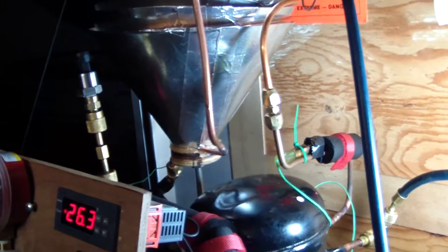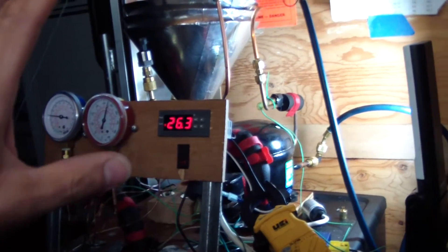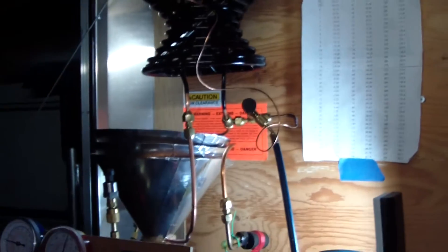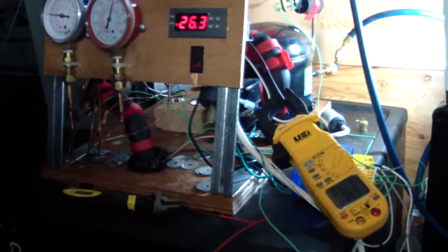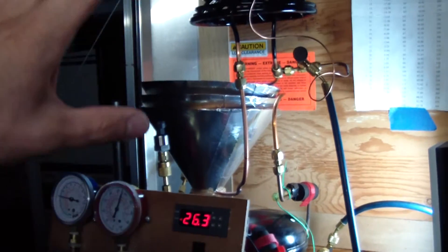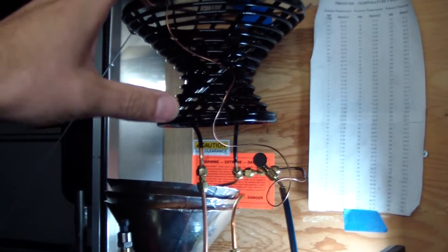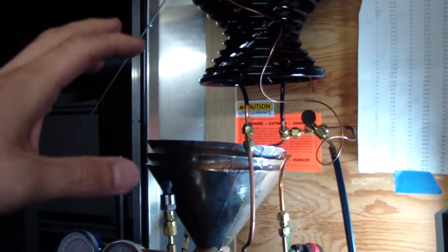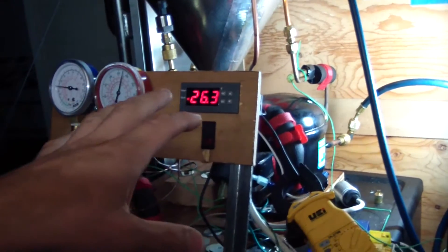There's a lot of reasons why I'm doing this. But essentially what I wanted to be able to do eventually was to build a small vapor compression refrigerator that has a removable condenser. It sounds like an odd thing, but I thought it would be a pretty nifty idea if I could make this thing modular in the sense that the cooling unit can be removed from the top of the refrigerator, and that you would have a large heat exchange surface that's aesthetically pleasing. That condenser could be removed and popped off without affecting or cutting into any of the sealed lines to the vapor compression system.